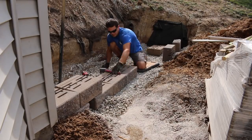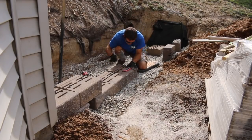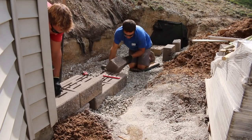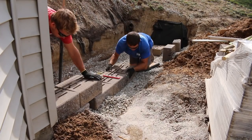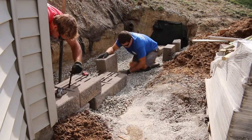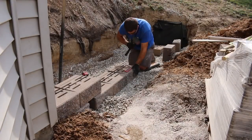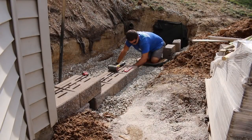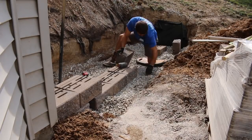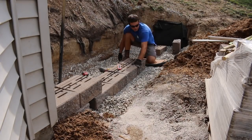That pretty much wraps this one up. I hope this video helped you out. If you're looking to learn how to lay retaining walls, this is a great start. It'll take some practice and a little bit of experience to get good, but this should give you a good foundation. Make sure you have the correct base and the correct leveling tools — whether that's the old-fashioned way with a line level and string line, or the more advanced laser level. Either way, just make sure you have a solid base and you should be in good shape.